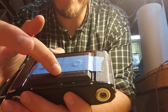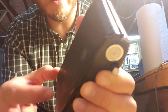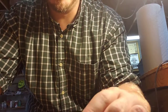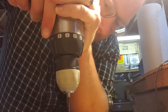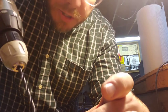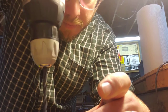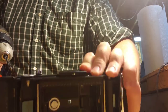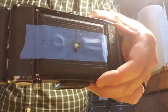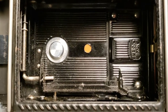I've marked out the center of the door, which I confirmed is actually centered over the film plane. I'm going to drill a starter hole here, then enlarge it to about 7/32nds. The hole is a little bit off center, but that's okay, because we're going to make a pinhole plate out of an old drink can and we can position the pinhole wherever we want.